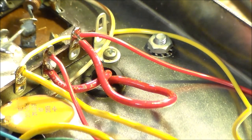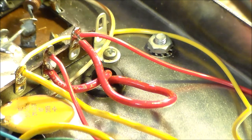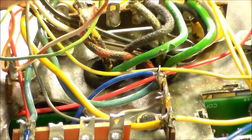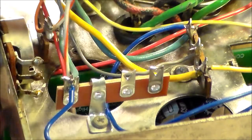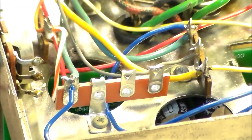All right, on a second red wire to the red A, which we did. Locate the white orange wire that is attached to the single lug terminal strip. Route this to the pad labeled orange on the PCB. Okay, orange is over here. So we're going down below like this. Strip that wire.